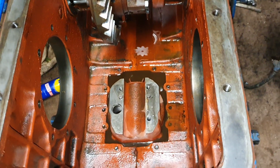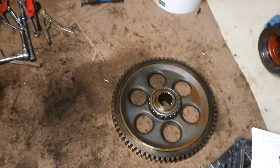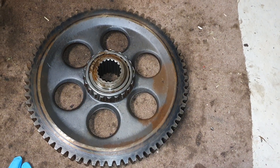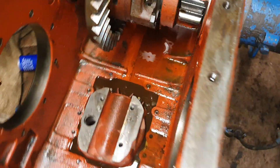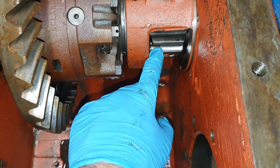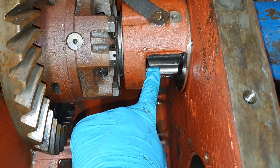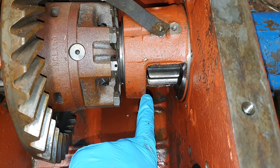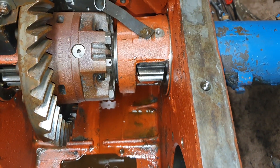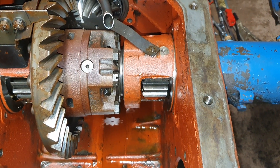The main thing you're going to want to remove is the large drive gear that sits in there — as part of the bull pinion shaft it rests against these gears here. You're just not going to be able to pull it out without first removing that large gear. It's a bit fiddly, be careful, it is heavy, but get it out.